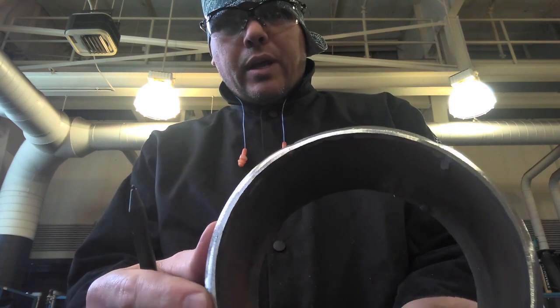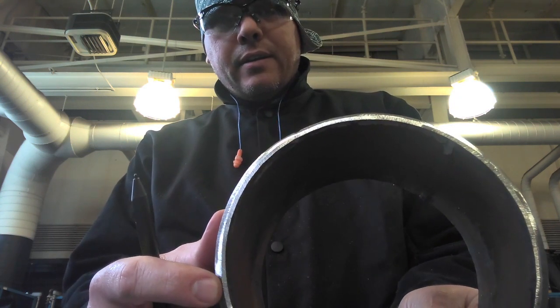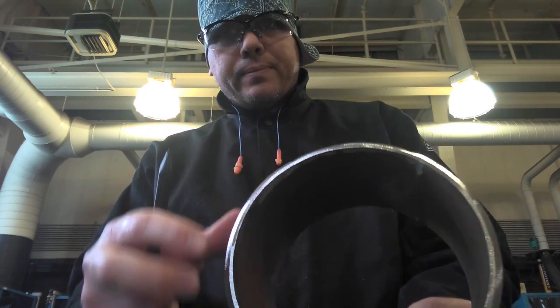Today I'm going to show you — we want an eighth of an inch landing and an eighth of an inch root opening. Eighth and an eighth, that's how we're going to do it. Some guys use a 3/32 landing and a 3/32 gap — that depends on what they were taught. In this shop, we're going to weld our 6010s uphill, and then everything after that, downhill, will be real easy. We're going to get those fitted up. I'm going to show you how to do it on the table or use a homemade jig to get your gaps and your tacks in.